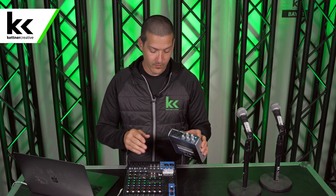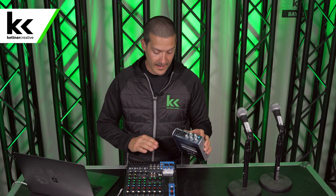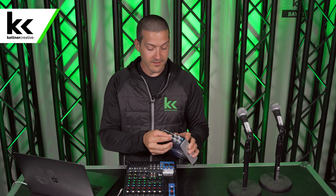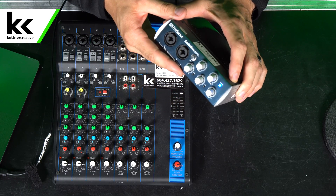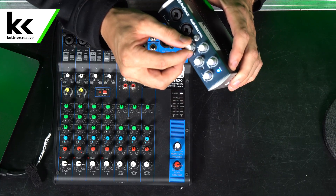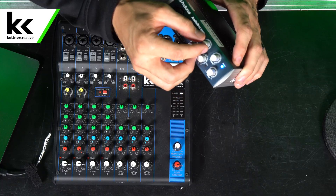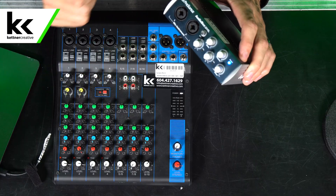For both methods we're going to connect the audio mixer to the USB audio interface, we will be sending a line level output. Everything that comes from an audio mixer will be a line level output. This is different than a mic level or instrument level output. So that means we don't need any help from the preamp on this USB audio interface. You can actually leave the volume for input 1 and input 2 turned all the way down, but you want the main output of the USB audio interface turned all the way up to 100%.